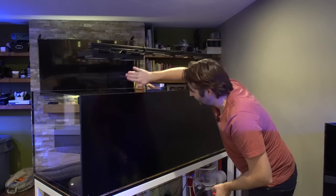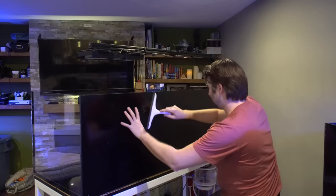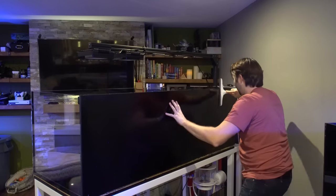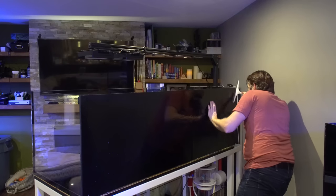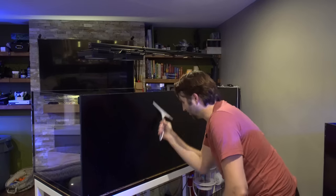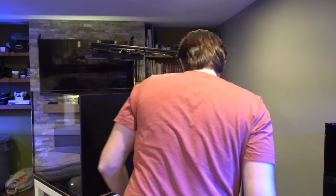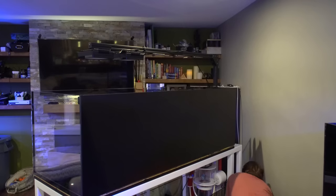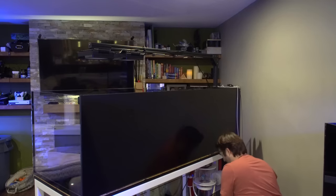No big bubbles — just a couple of little tiny fingers we can push out. Shoot it one more time with water and now we're going to squeegee it out. Do a strip along the top to set the vinyl, then work down the middle and squeeze out all those bubbles and water — that's going to help it adhere to the glass. Use quite a bit of pressure, and make sure you quickly wipe up any water you may have spilled on the floor during this process — we're definitely spraying a lot and it finds its way pretty much everywhere.